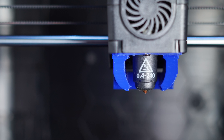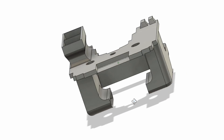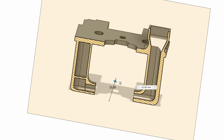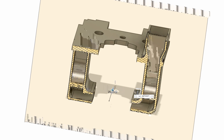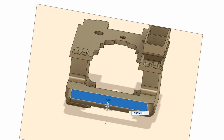The fourth modification I did was printing dual nozzle fans. The dual nozzle design doesn't always work, especially if you need a high-powered fan, but it shines when you want airflow from both sides. I've got multiple iterations linked in the description. This latest one has reduced air resistance through all the bends and turns, keeping the path as straight as possible to salvage as much airflow to the right side of the extruder.